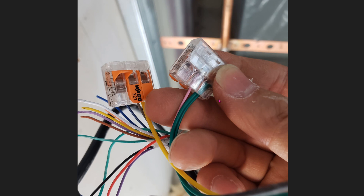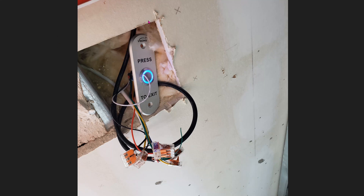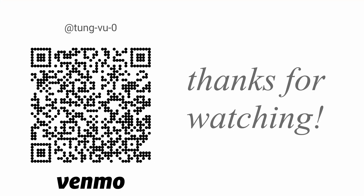You really don't need to have a push-to-release exit button, but if you want you can always make the connection. The green wire from the push button connects to the keypad's pink wire. The yellow — which is NO from the button — connects to the gray wire of the keypad. Here you can see the black wire coming from the keypad outside, the white wire coming down from the power supply, and here's the push-to-exit button. Hopefully you found this tutorial helpful on how to install an electric strike. In the next video, I'm going to show you how to automate it using a Shelly 1. I really appreciate you guys subscribing to my channel — thanks for watching.